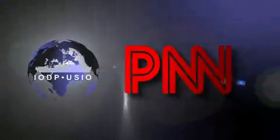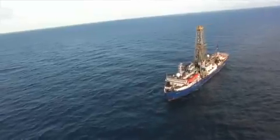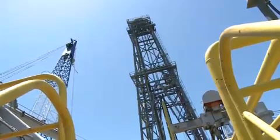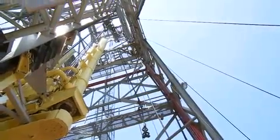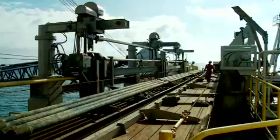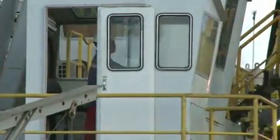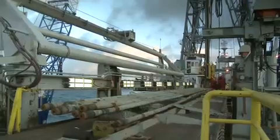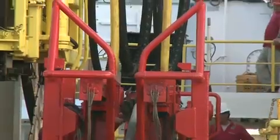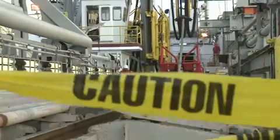This is a real deep water drill ship, so we have a lot of heavy tools and high weights that we operate with. The derrick is 193 feet off the water line and it's rated for 1.2 million pounds. After that you'll see the big long skate area — that's where our pipe racker is. This ship is quite different from most modern drill ships in that we have a horizontal pipe racker, whereas most new ships have vertical rackers for all of their pipe.